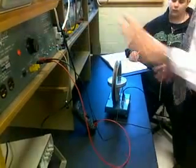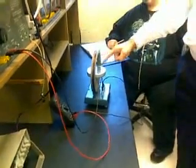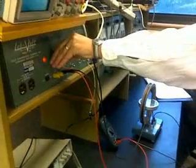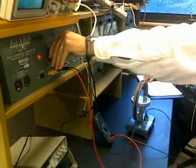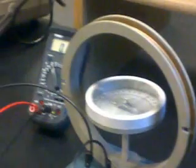Since we have a digital meter to read current, the easiest thing to do is to set the angle to 10, 20, 30, 40 degrees rather than reading 16.42 degrees or whatever. The lab manual says don't go above 60 degrees, so go up in 10-degree increments. All right, so now we've got an angle of 10 degrees and a current of 0.14 amperes. Let's analyze that one data point.